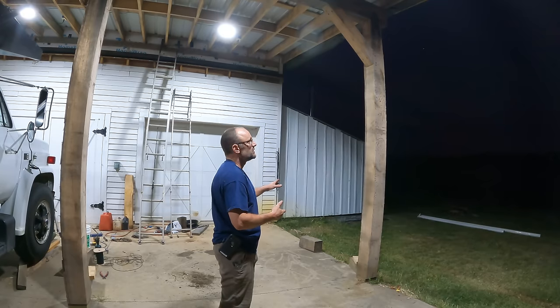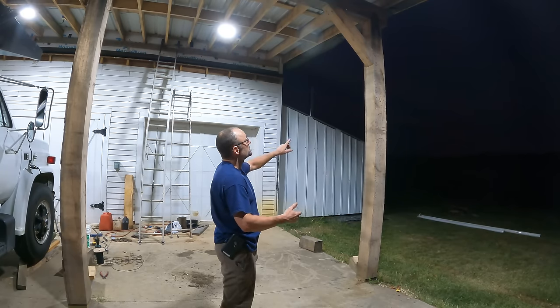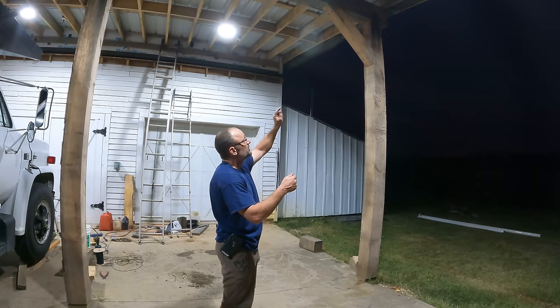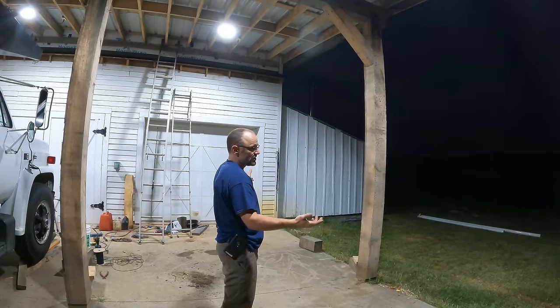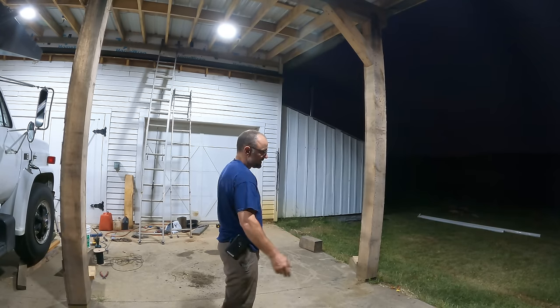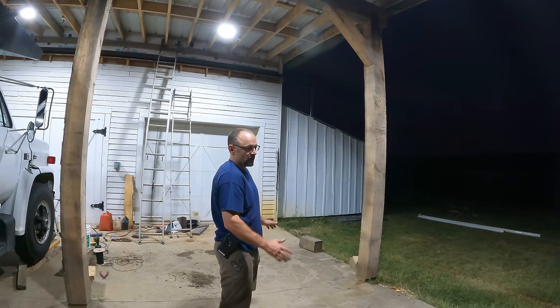And I don't think I did it the most efficient way. I think I should have measured out where it goes, put up the fixed lines, put up the eye hooks, put up the pulleys because they're right across from the fixed lines. Get your lines all in place, then put the tarp up and put the bottom on it and it'll roll up. Don't have the tarp there in your way the whole time you're working with the lines.